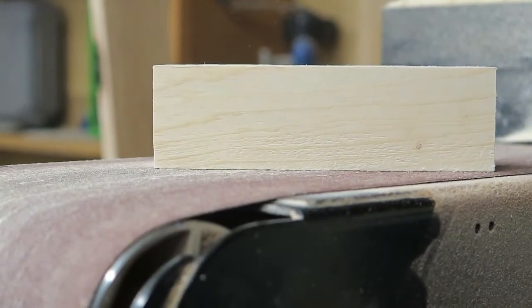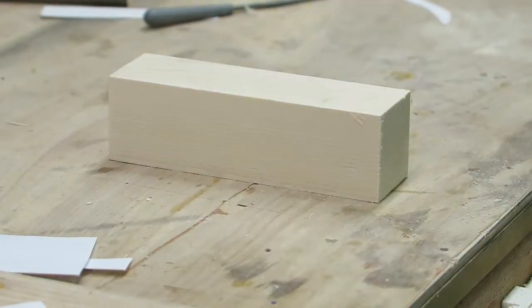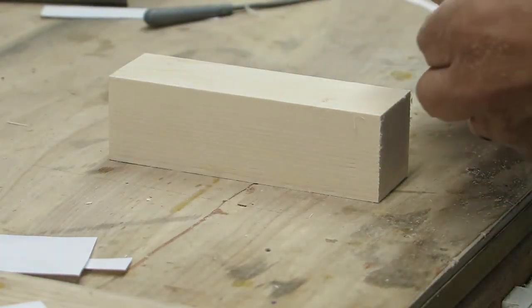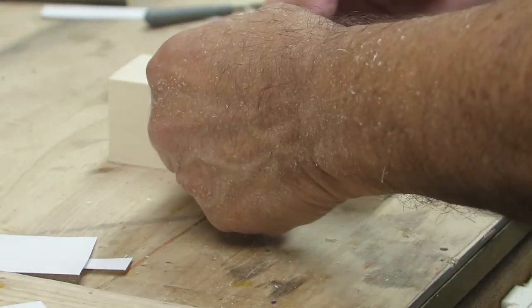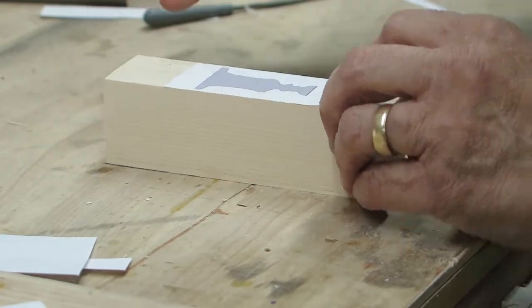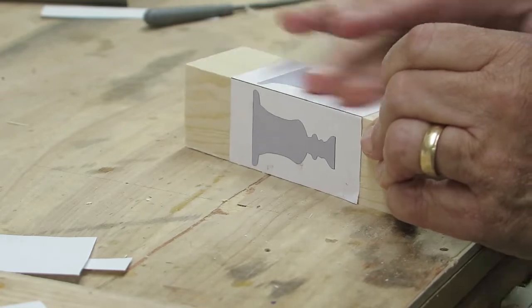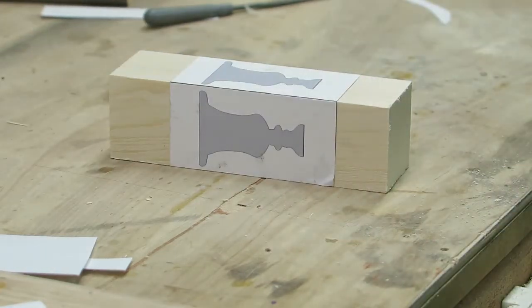So we can attach our pattern and start cutting on the scroll saw. Let's go attach the pattern. I've used a glue stick to gum up the back of this thing. What we're going to do is take our urn pattern and place it so that the seam in the middle is right on the corner on the right-hand side. It ought to fit nicely across the block if you cut it properly — it's one and a half inches. So that'll be nicely put on there like that. Flip it over and do the other side. Make sure it's down nice and flat. We don't have to worry about using tape on this because we're using a number nine blade, and this is a very soft wood, so it should cut with no problem at all.